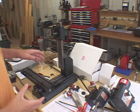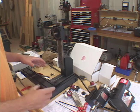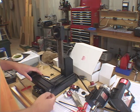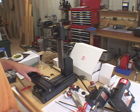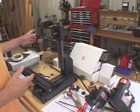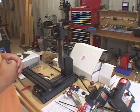The instructions are assuming that you're going to leave these components bolted together and tap in place. But I want to make sure I get a nice consistent straight drill because I can't do it by hand very well I'm sure. So I'm going to take these pieces off and take them over to either the larger mill I have over there or the woodworking drill press, and do the drilling and tapping with those.